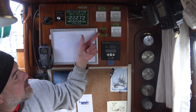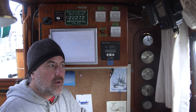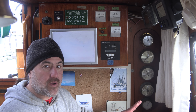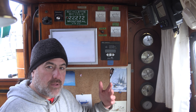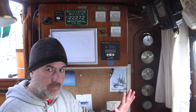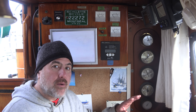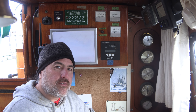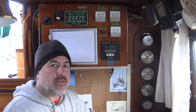This is the braking switch. The braking switch lets you put the D400 into braking mode where the blades slow way down even if it's very windy outside. This is so that you can turn the D400 out of the wind so that the blades stop entirely and then go up and tie a string around them to secure them. It's very important to realize that the braking switch is just for slowing the blades down prior to securing it by hand with a string. You should never leave the braking switch engaged without securing the blades immediately afterwards, otherwise damage may occur.